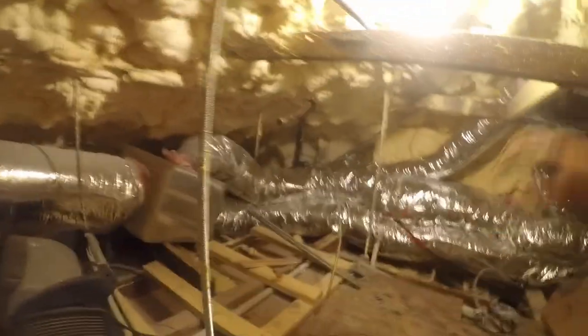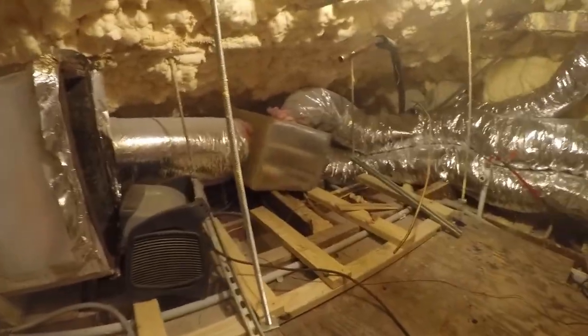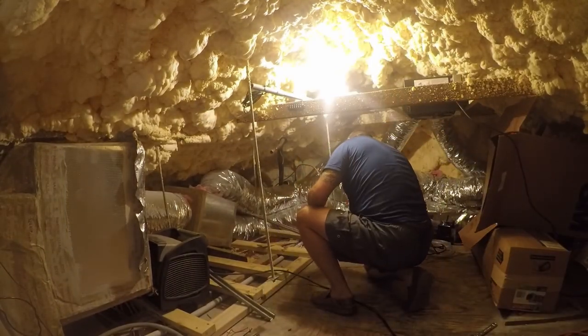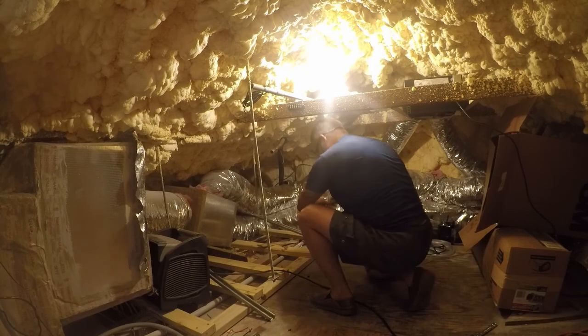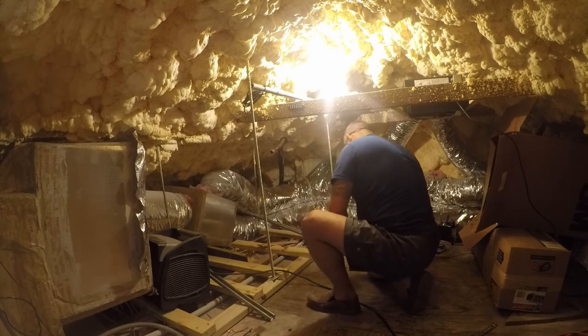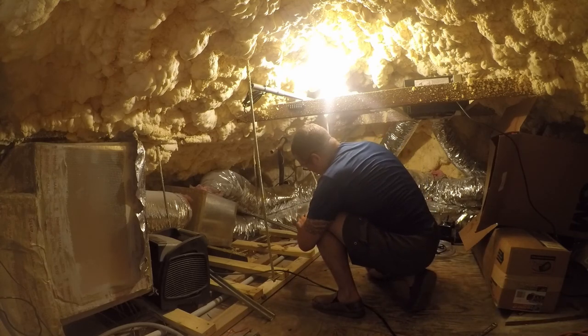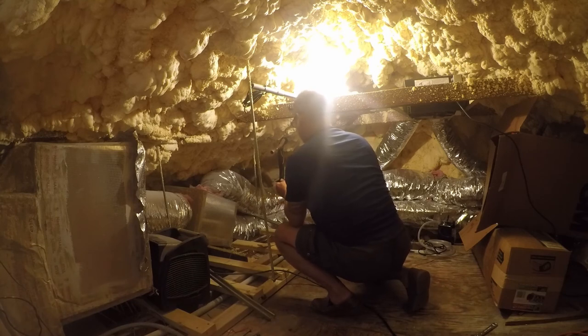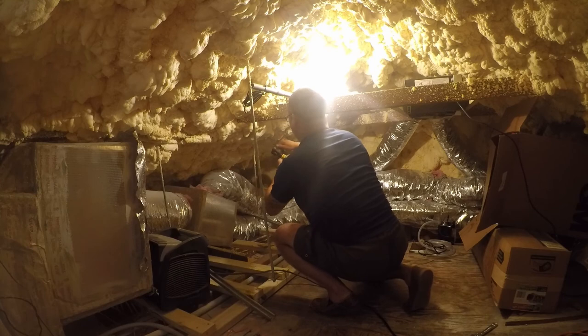All right, so I got a little cleanup to do there, but this is out, and that sets the way for me to do remediation on the thermostat wiring and the copper tubing. So I'm going to mess with the copper tubing now. Basically what I'm going to do is come in here and just recut this, try to cut as little off here as possible, but I want to be left with a clean end. So it's really just that simple, and that saves me a couple inches of this material. Now I realize I could have unbrazed it, but this is quicker and simpler for me, and I don't have to break out my brazing rig. I really don't like to have any more fire inside the foam attic than I absolutely have to.